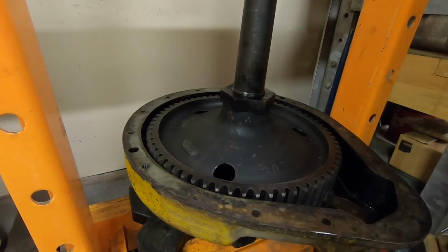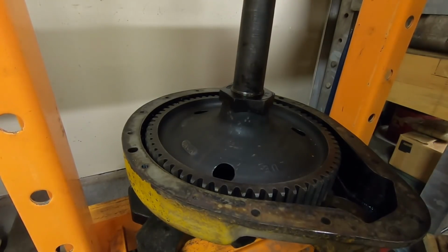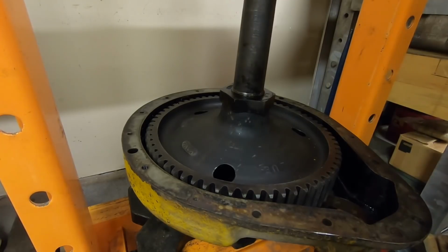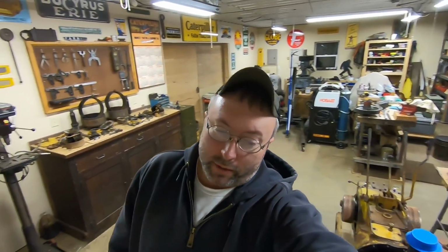And then that fell off, so I clamped a piece of steel to the top, and I hit it a few more times, even harder. And that still didn't work, so I left full pressure on it all night long, came back in the morning, and sure enough, it was still tight, nothing had popped. So I wheeled the whole thing outside and put a little bit of heat on the hub. Tried it all over again.